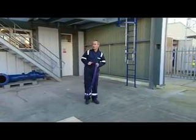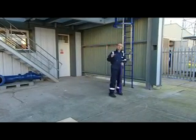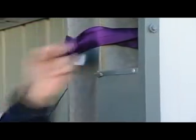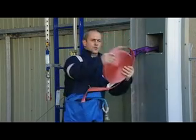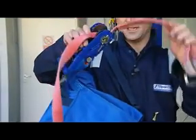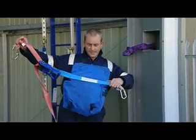The span we're doing at the moment is probably around four or five meters, but don't forget the horizontal safety line can go to 20 meters. The kit is stitched into the bag so nothing can go missing. We've got our 20 meters of webbing, which we can place on the floor for now. Also in the bag you should find a ratchet for tensioning the system.